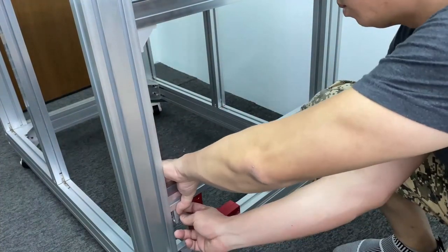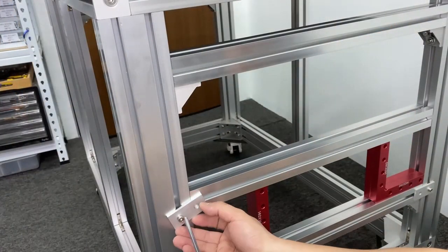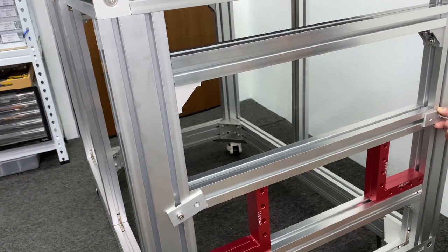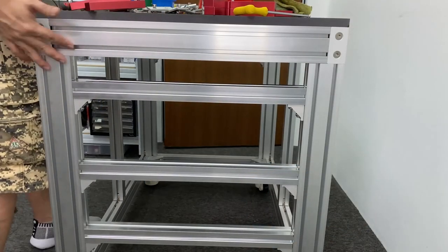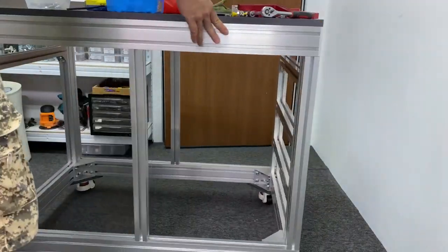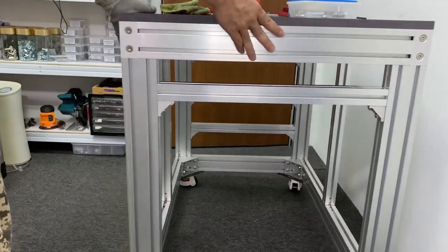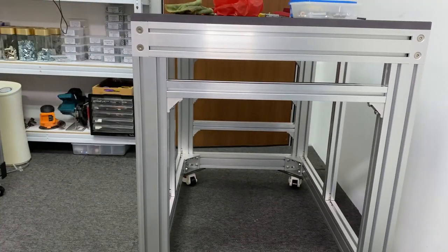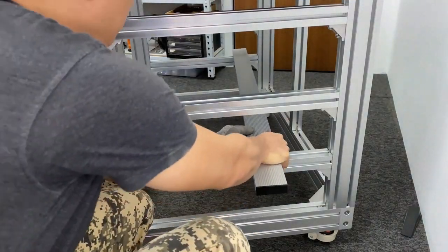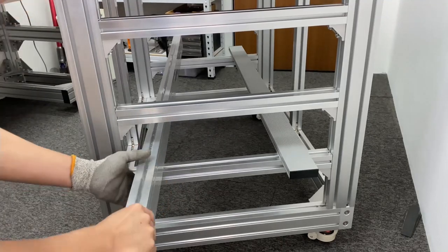With the table right side up now, I can start fixing up all the arms holding the drawer slides. The arms in the middle are more tricky. They have to be completely parallel to the arms on the sides because all the drawers will have to share the same arms in the middle.